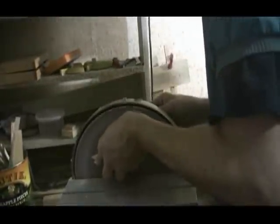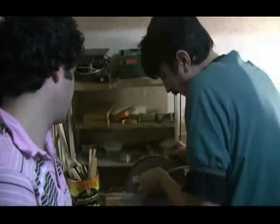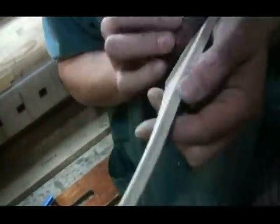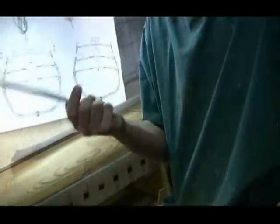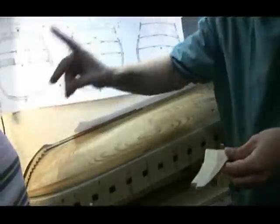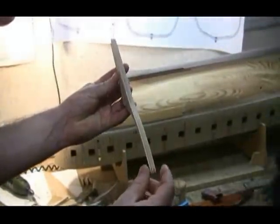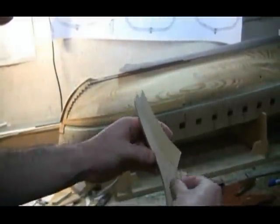One side. Now this angle, very perfectly. And what after? After finish. So just in case everyone's missed it, he has actually done that tapering now. You can just notice that subtly, purely on a disc sander, remembering not to let that surface come in contact with it. You're just grinding from there down, leaving that all untouched.